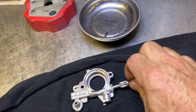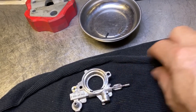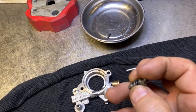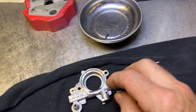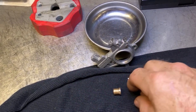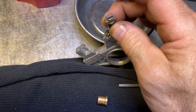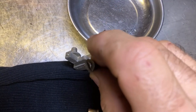You have your shaft here — the brass bushing rides right on the end of the shaft. And you have your adjustment screw; the flats on the adjustment screw go to the flats. So you have a quarter-turn adjustment with it, just like that. There's your flat — that's how that goes back together.